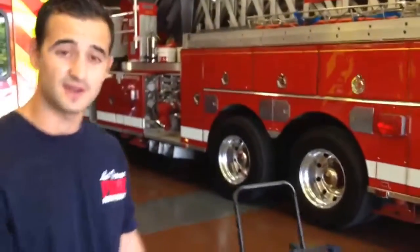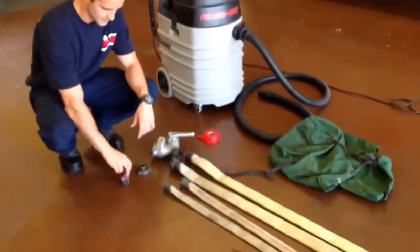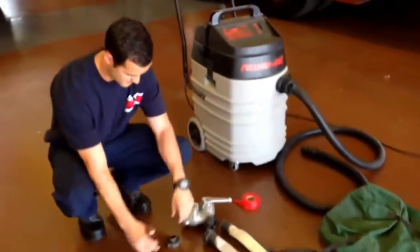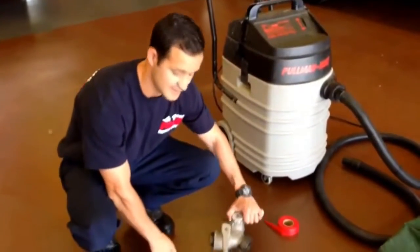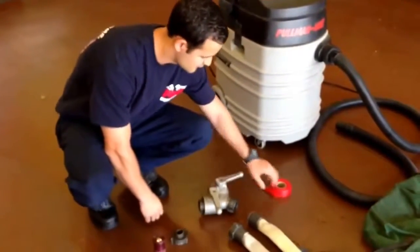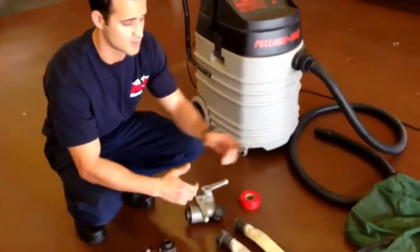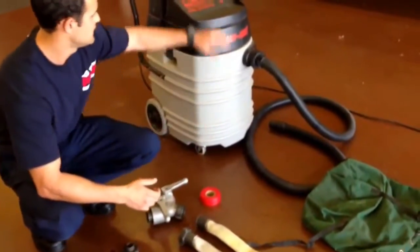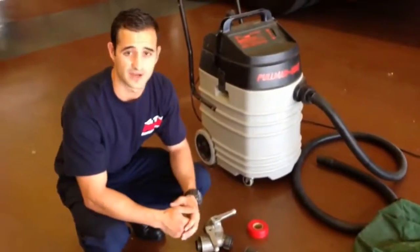Today's training video, we are going to demonstrate how to roll a smokey pack. A smokey pack consists of 100 feet of inch and a half hose and 100 feet of inch hose. We also have a nozzle, an inch and a half to inch reducer, a gated Y, and flagging to keep the inch and inch and a half hose together. We have our pack which we are going to load it in, and our vacuum to set the air in to make the folds nicer into the bag.